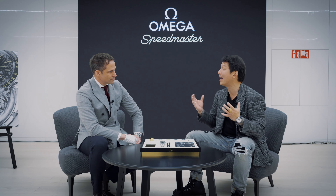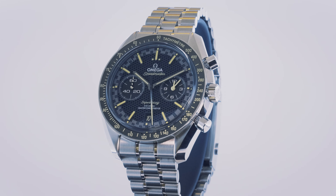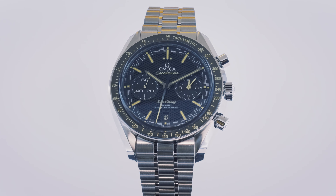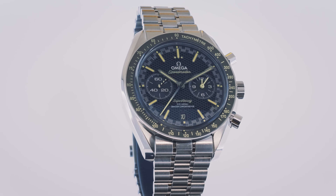Spirate, yes. So let's talk about this because it is just mind-blowing. I understand that there are two systems in terms of how watches are regulated. You've got a free-sprung balance wheel where it's just basically these inertia screws that you're adjusting. There are certain limits to how much you can adjust it — we are talking about the fineness. In our case, it's plus or minus one second a day. Or there's an option to change the active length of the spiral itself, and that's called a regulator, like a swan neck, for example.